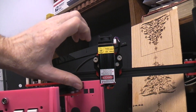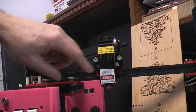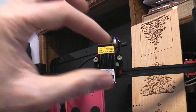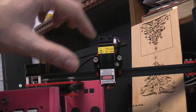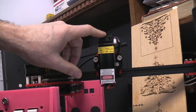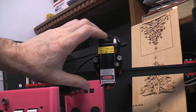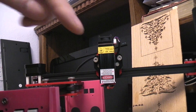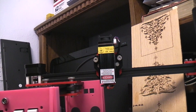Just before Christmas, my wife wanted some wood things cut, so I tried cutting all the way through some wood. I had some three millimeter thick basswood and it cut the object she wanted. I had to go down to 100 millimeters per minute and run it at 100 percent power — this is the five-watt unit, sold as a 20-watt laser head, which means five watts of actual optical power. It burned through in some places in one pass, so I had to do two passes to get it 100 percent through.